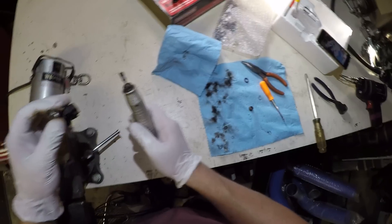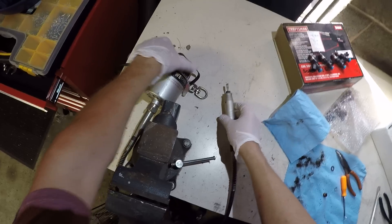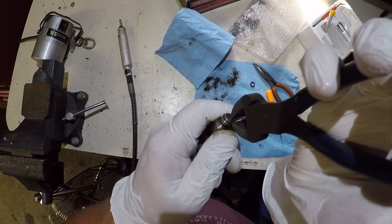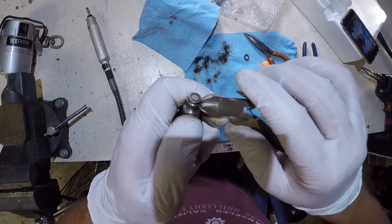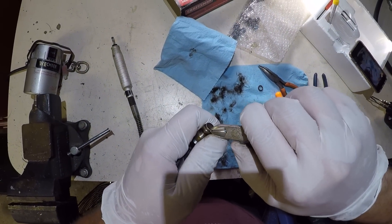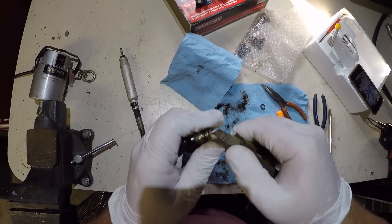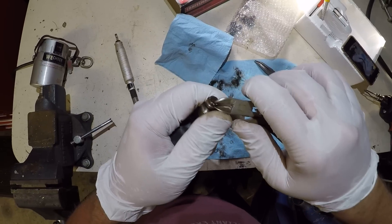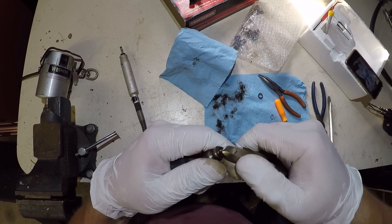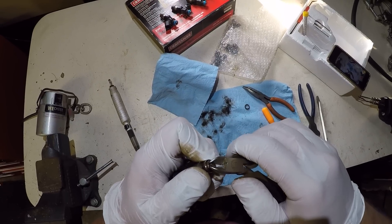Under here is the little pintle, and these are restricting the amount of flow. What you want to do — I use this rotary tool; he was using a table grinder. You can actually pry up on the lip on these. You can cut the edge of this and peel it, but where that spot weld is you can't fully get rid of the cap that way. It is very well tacked in there with friction or spot weld, but you can take this whole lip off.